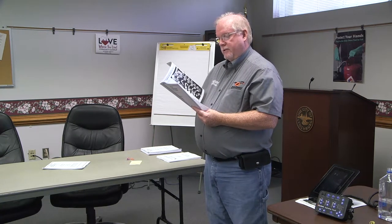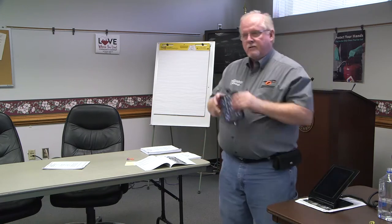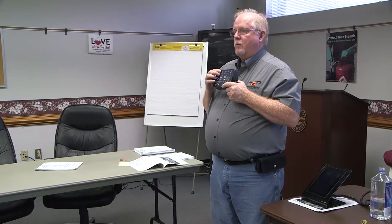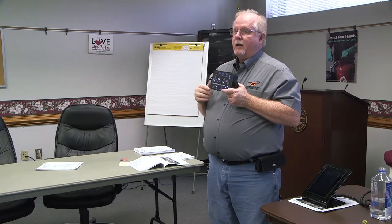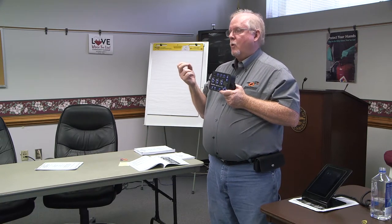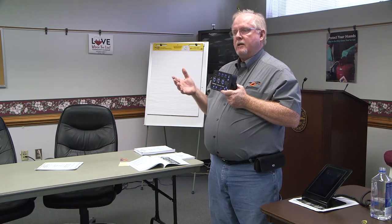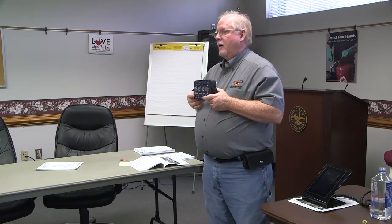Most of them we don't use. One that was nice is step 32, page 16. What that does is on this panel here, when we turn this system on, it's sending minute amounts of current out to that coil and sensing the current coming back — number one, to know whether or not we got continuity in the wire, and number two, to know whether or not that coil's bad. So if we get a light that blinks slow every once in a while, you'll want to check it out because you may have a break in the wire, a dead short somewhere, or a coil that might be going out. Without firing the valve, we can send such a small amount of current to it just to detect that the valve, coil, and all is still there.